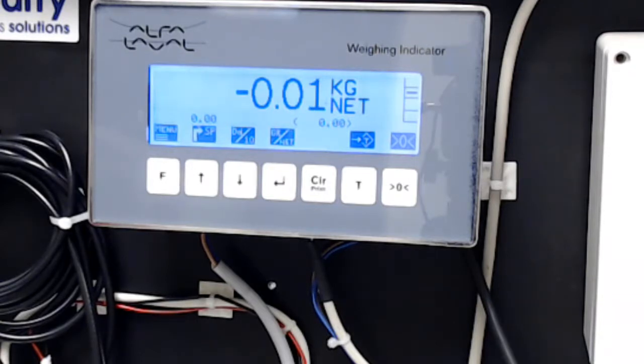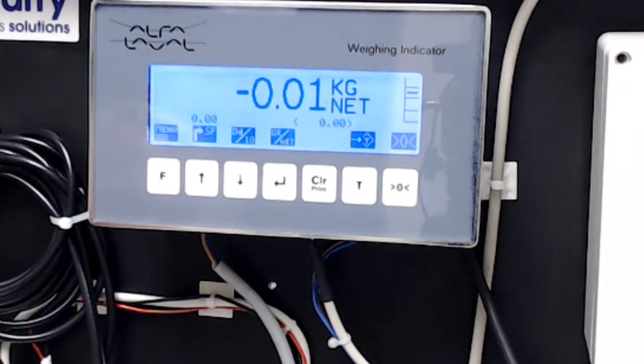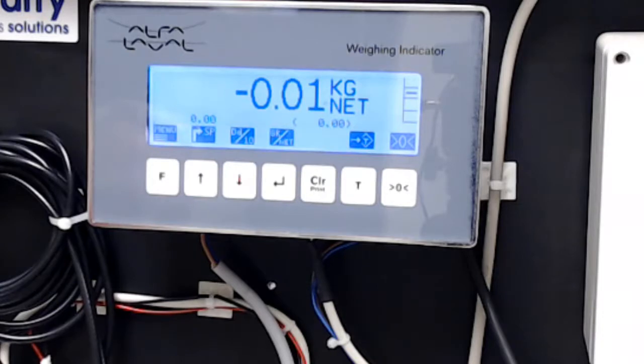Dosing applications are those in which you want to control a fast fill and then slow the fill as the vessel begins to approach full. The system has the ability to control a piece of equipment — whether it's a valve, pump, or something else — and turn it off when approaching full so we don't overshoot. We won't cover that today. The third key increases the resolution of the system by a factor of 10, which is helpful when troubleshooting. It takes the reading out an extra decimal place temporarily and returns to standard settings after a moment.